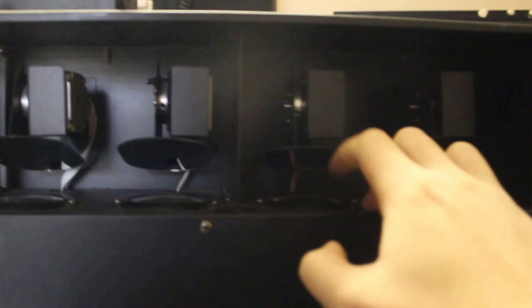All of these motors have a small screw there at the back. I don't know if you can really see it, but you can see it on that one maybe. That's a thing that the system uses to index where the motor is in relative space. This one does not have a screw, which means every time it boots, the mirror hits the top. While in these, it's not physically possible because of that screw. And for some reason, this motor is making a lot of noise, so I'll just have a look at that.